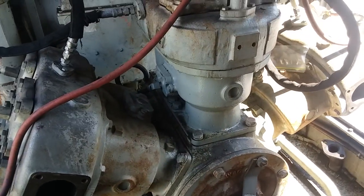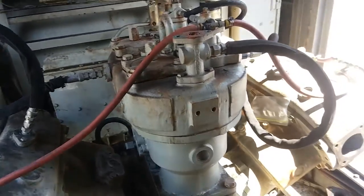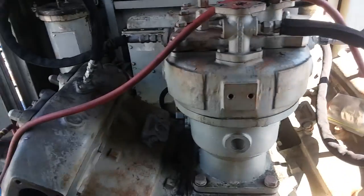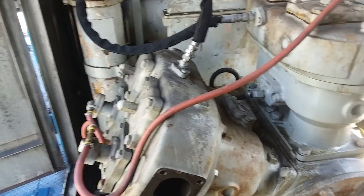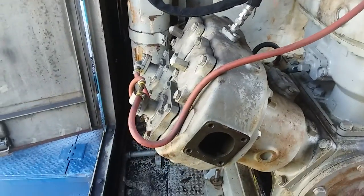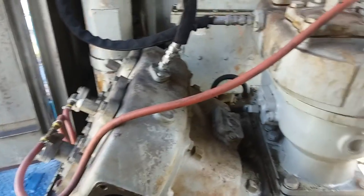This is actually a two-stage air compressor. It has three cylinders on it and it operates at 900 RPM. The engine puts out about 254 cubic feet a minute. It's a water-cooled air compressor and it has about ten and a half gallons of lube oil in it. But it's got some problems.